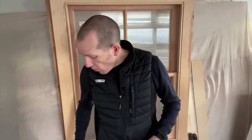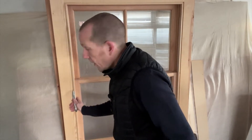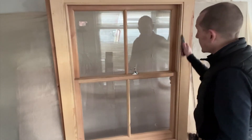Number one: remove the staff bead. So first things first, the first thing we've got to do is remove the staff bead. I've got a nice fresh clean box sash window here, but obviously you're going to have a box sash window covered in paint. So the first thing you're going to do is get your knife and score down the staff bead, to create a little slice in the paintwork so hopefully it's going to stop the paintwork cracking out. You would do that on both sides.